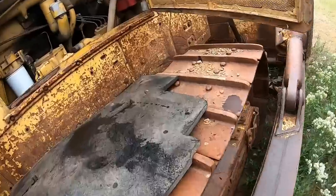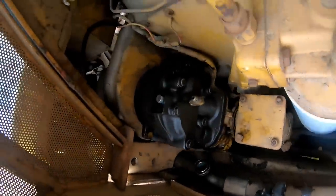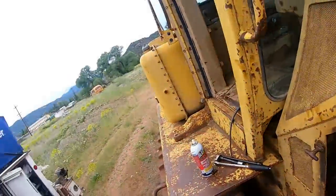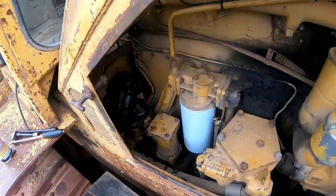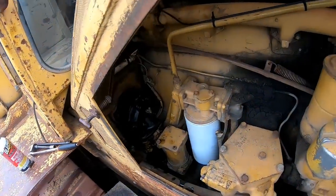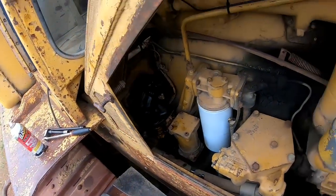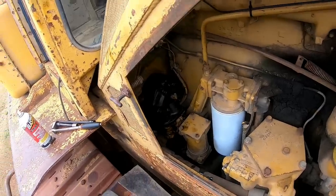I've worked on a lot of these feedlots over the years. Used to work in a truck shop, too. That's where I kind of started mechanicing after I got out of the Navy, was truck shops. Cow haulers would come in, and we'd have to do slack adjusters or anything back there on the trailer, on the suspension. We would clean the threads, clean our S-cams up real nice, and put the expensive copper, $50 bottle anti-seize on them.